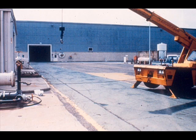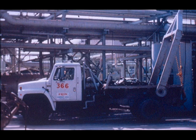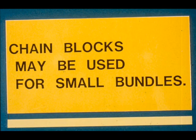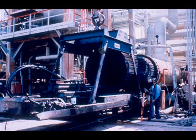The power for pulling the bundle may come from a winch on a crane, or a special piece of equipment like an A-frame truck may supply the power. A hoisting tugger winch can be used to pull a bundle in a hard-to-reach place. For some small bundles, chain blocks may be used. Some locations may use a hydraulic bundle extractor, which is useful when access to the bundle is limited.